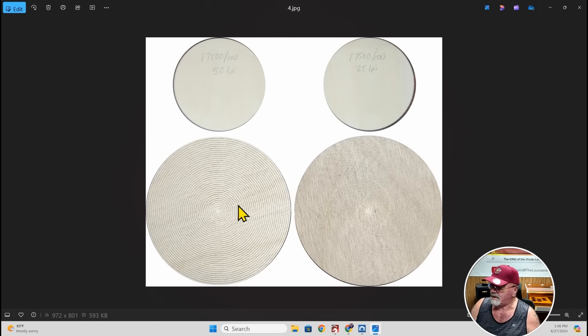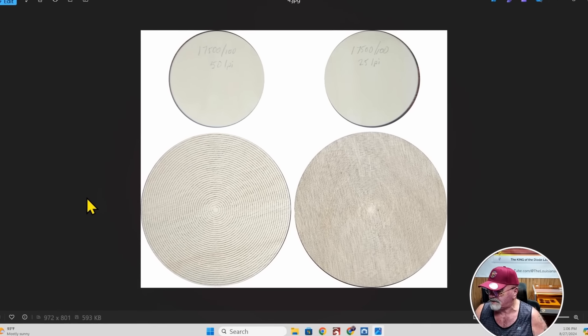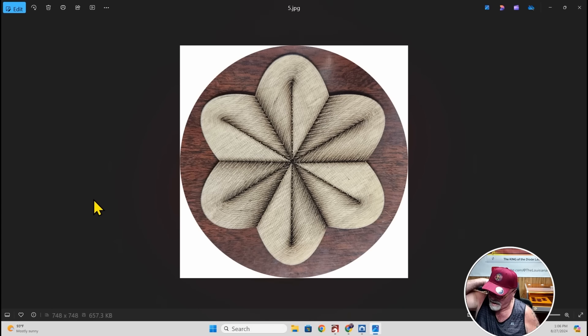The next one is the spiral — the offset fill. These are both the same settings, just different LPI. This one is 25 LPI and you'll get the anomalies of that spiral, and this one is 50 LPI — a big difference in the look just by changing the LPI while speed and power stay the same. Here's a sample of some testing I did to make flowers — one cut-out piece all the way around with one setting, using the offset fill to get different shades. I didn't want to go any darker in the middle, and it came out pretty good — these went in an Easter basket.